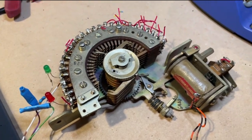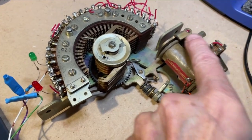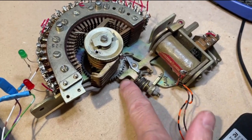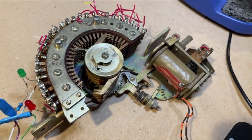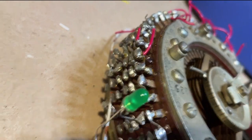This is a rotary stepping switch built by Automatic Electric Company, probably in the 1950s. There's an electromagnet here that, when engaged, takes 48 volts, moves this ratchet, and traverses these wipers around this arc of 27 positions. Each position has six contacts permanently connected on the outside.